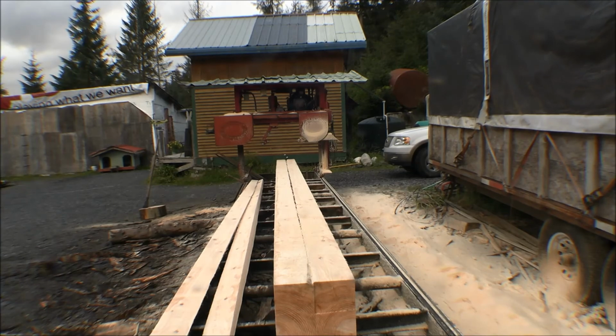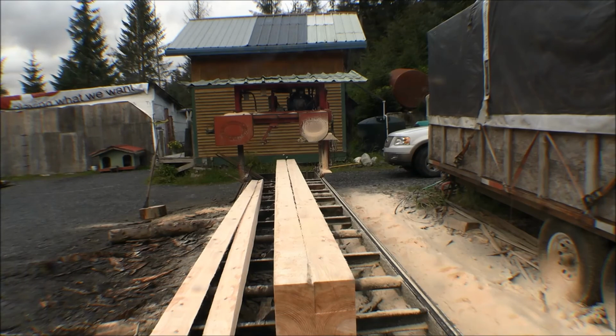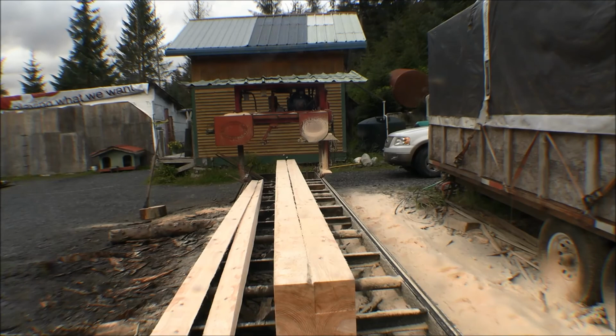So now what I need to concentrate on doing is I need 1x12s. And since the trusses that I have are 37 feet wide, there's a 1 foot overhang, so that's say 39 or 40. If I used 1x12s, that would mean I'd need 40 1x12s. But then we got the pitch of the roof to worry about too. So that means, let's say three more. So say 45 1 by 12s. That's just for a 20 foot section, actually an 18 foot section, because there'll be a 2 foot overhang over the end. 40 foot section, I'll need twice that many. So I'm gonna need over 100 of them.